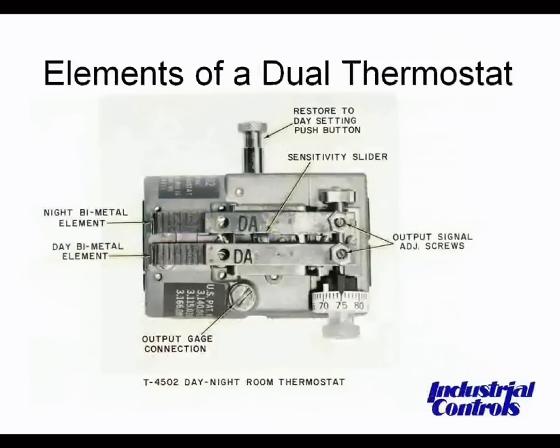The first picture shows a single controlled temperature thermostat. This is a dual thermostat — it controls at two different temperatures. The thermostat operates at 15 pounds, typically for a daytime setting. At night, the supply pressure is converted to 20 pounds, which switches the unit internally to the second bimetal strip. These are adjusted for different pressures. Typically, a daytime thermostat in a northern climate would be set for 68 to 70 degrees, and at nighttime for 58 to 60 degrees — usually a 10-degree difference.